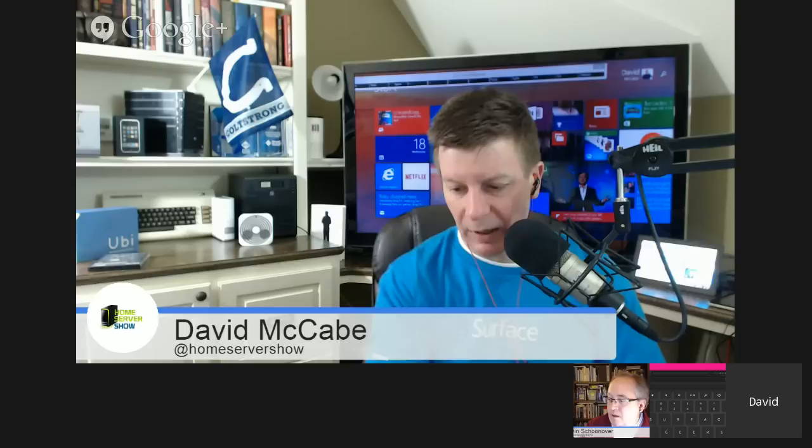Actually, I have an actual VGA plug here with solder cups on the back, and I'm going to fix it up and probably heat shrink around it and make it real nice and pretty, and then I'll plug it in and zip it away. But I was able to Chromecast to it and send audio to it real nice. So it's just a device that I'm not using. I bought it, I'm not using it, so I either sell it or I try this.